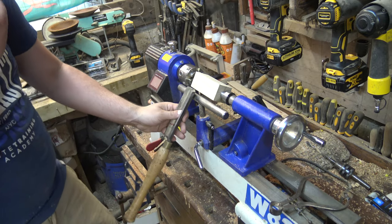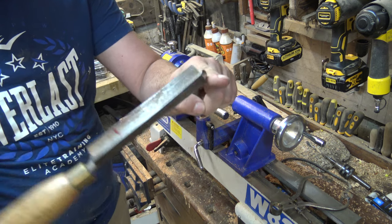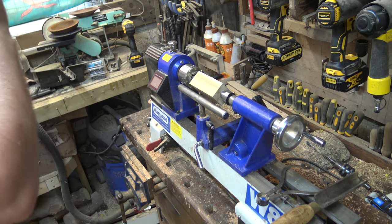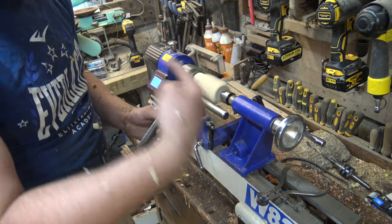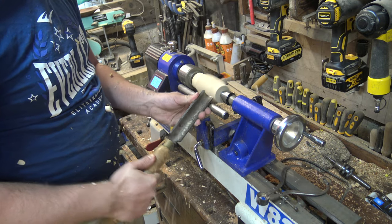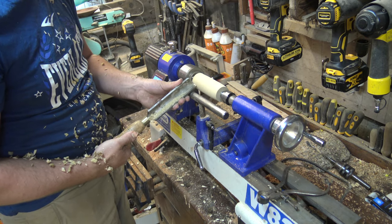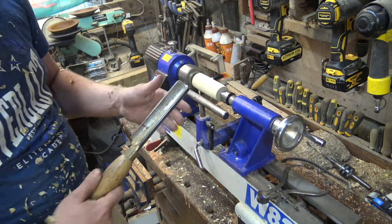Put the tool onto the rest, handle down, find the bevel — that grind angle — place it onto the work, then lift it up and get it to cut. We're going to put this into the round first, then set a pair of outside calipers to find the size this needs to be. Working in from out to get rid of the edges — if you work out from in you're more likely to tear. Tool on top, still getting some bouncing as we can see, still not fully in the round so we can take a little bit more off.